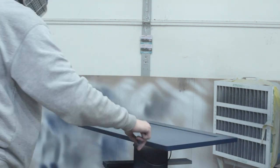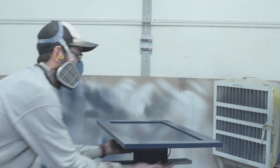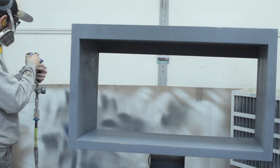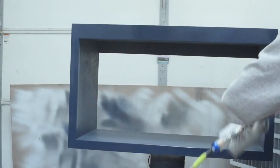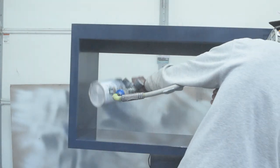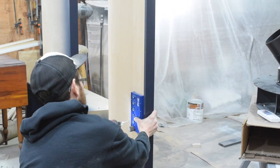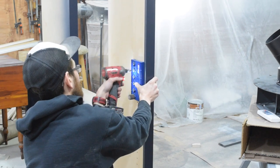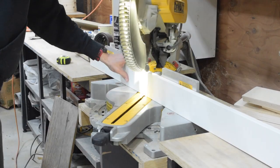This is actually one of the last projects that I'm going to spray with my HVLP gun — my compressor quit not too long after finishing this project up and I switched over to an airless sprayer. The HVLP is a slower spraying process, but it is radically more efficient than the airless sprayer. The airless sprayer uses about twice the amount of paint that you would expect to use with an HVLP gun.